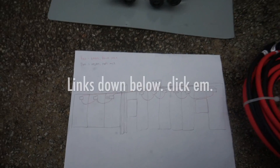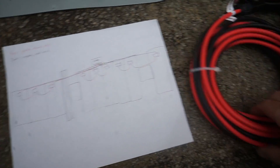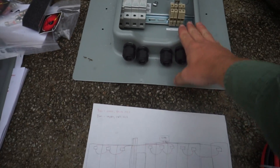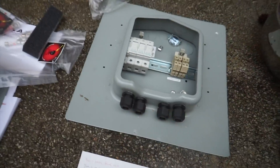To do that, I need solar extension cables with MC4 connectors — bare at the other end to make our run. This is like a 25-foot run, this one's about 10 feet, and that's 25 feet. We're going to attach this to the top of the bus, then send a wire through into our electrical cabinet where it all goes to the next piece of our puzzle.